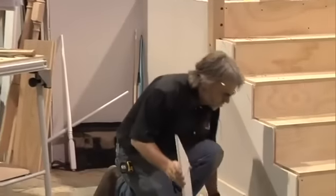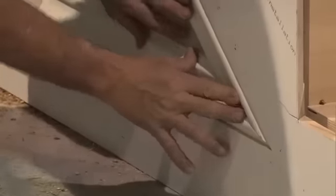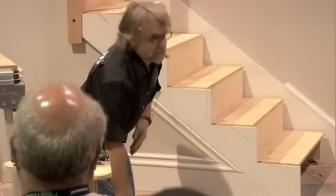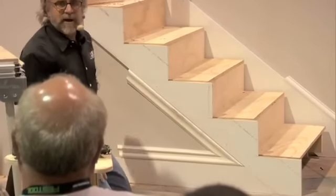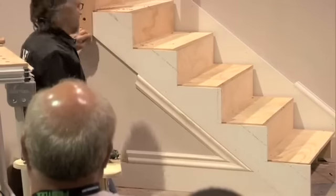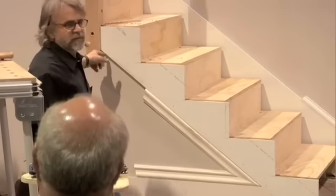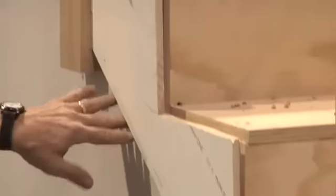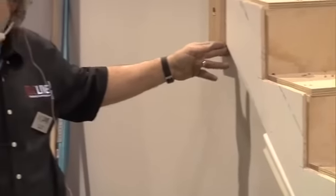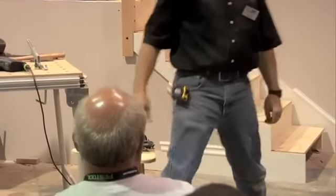Now, obviously, if I had been doing this on a job site, I would cut this joint here first on a longer piece, and then come back and cut it right here. As you know, this angle here is actually a 53.3 degree angle, because I'm going from this 37 to vertical. So I can just cut it at 36.7, and it would be fine. There's your real snappy looking, very acute angle miter.